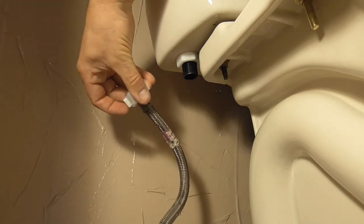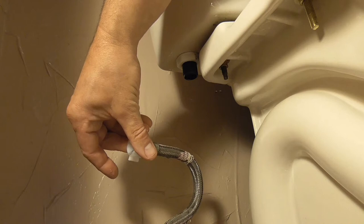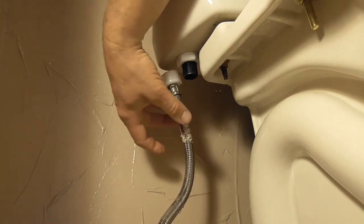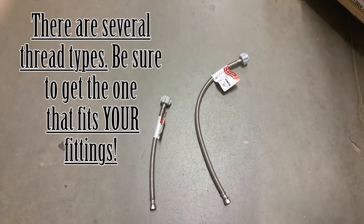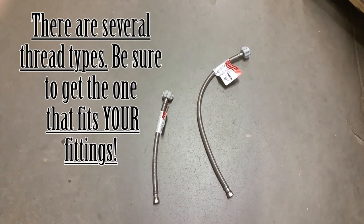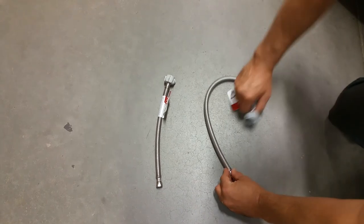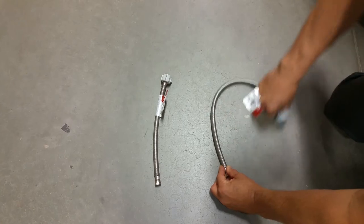If you have a steel line, you can unthread the bottom fitting and put it aside. You can then replace it with a flexible braided tube instead, which will give you much more flexibility for movement. This is optional. They are cheap and come in many sizes. Just be sure that whatever length of tube you are purchasing is long enough to avoid being pulled or kinked afterward from being the wrong size. These tubes can also safely make a long turn like this if required.